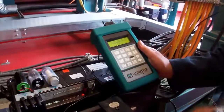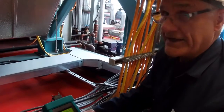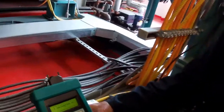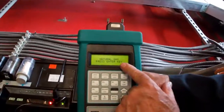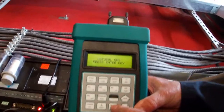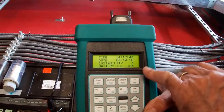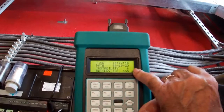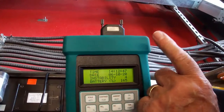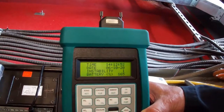We've got 210 seconds to go. Now I'm down to 4 seconds left in the calibration — 2, 1, 0. It now wants to know what fuel I'm set up for. I'm set up for natural gas, so I hit the enter key. It has an instability factor which typically goes up and then comes back down again. If it keeps going up, it means the O2 cell is shot.